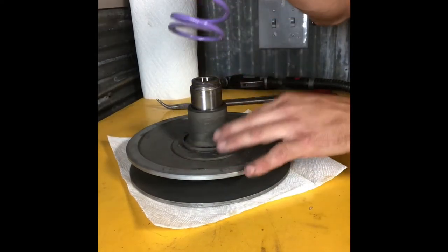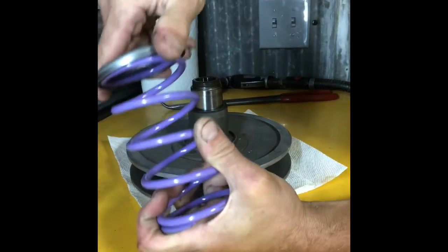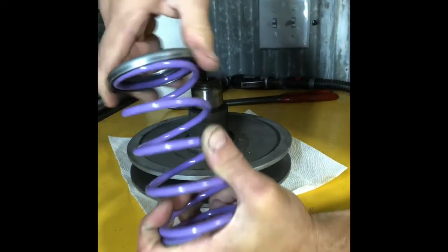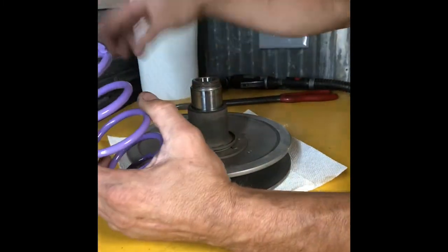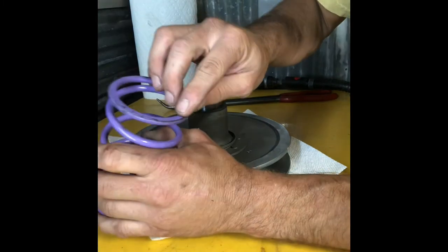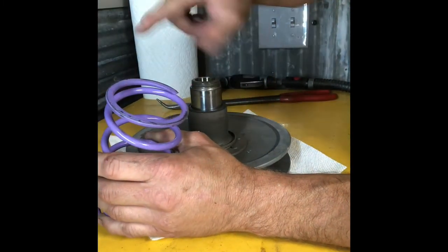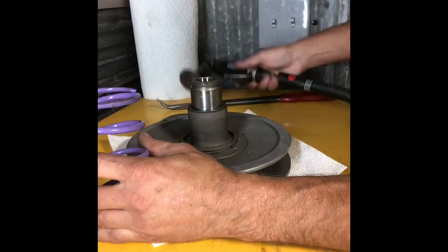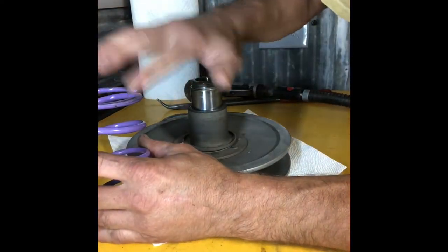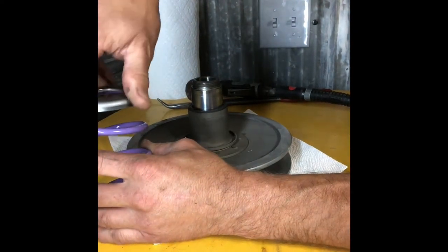So as this rotates, the nut's tight on the threads and this is compressed — it will be fighting this. You want the spring to move smooth inside the sheave. I'm putting slippery washers in this one, but you can see the cut in here is just not real smooth. It frees up and then moves better. So before going back together, or when you're doing it at home, it's always good to take some sandpaper or a buffing wheel on a die grinder and just prep this up where the cup at the top doesn't bind at all — it moves real freely.